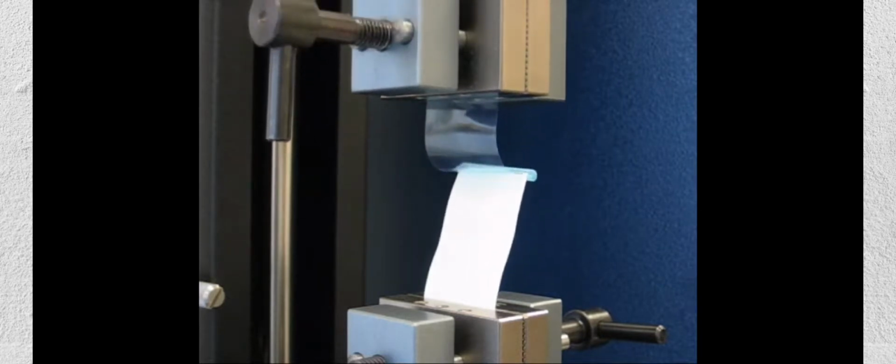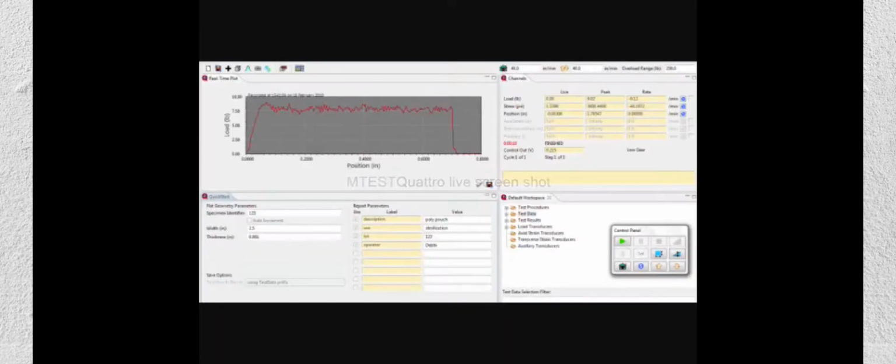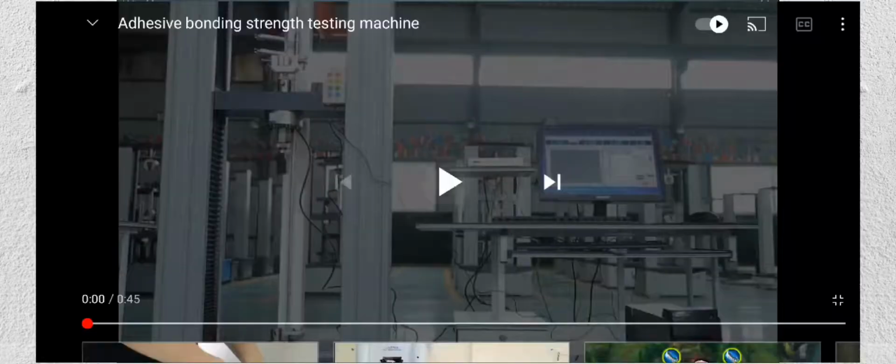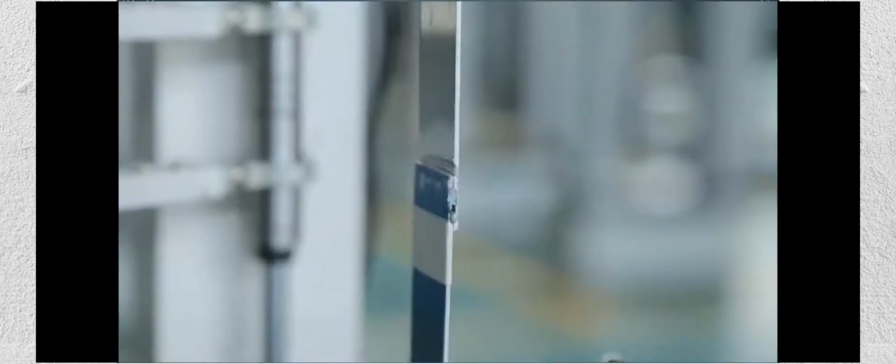The final result checked for seal strength test is maximum force. This test is performed to check how much force will be required to open a particular package. With the help of this result, the actual seal strength is optimized at the packaging line by controlling seal time, temperature, pressure, etc.